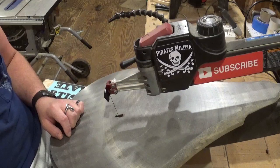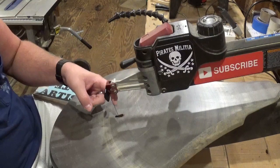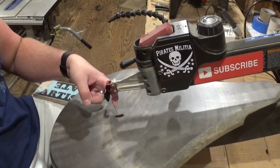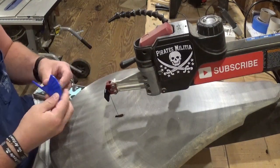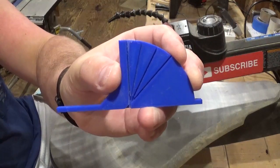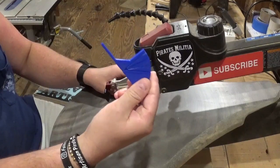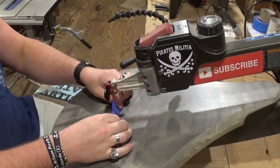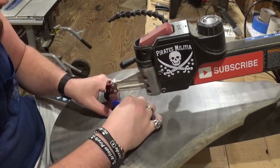Since everything is prepared and we're ready to begin scrolling, let me move the camera over to the scroll saw and we'll get started. Alright, over here at the scroll saw, I have a fresh number 5 ultra reverse scroll saw blade installed, and before we begin scrolling, I want to double check to make sure that the scroll saw is at a perfect 90. To do that I will use my 3D printed scroll saw leveling tool, and I'll leave a link in the description box below where you can get this file for free to download and print one if you have a 3D printer. Looks good that way, and a perfect 90 that way.